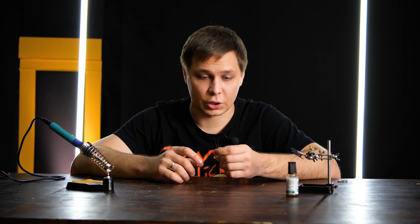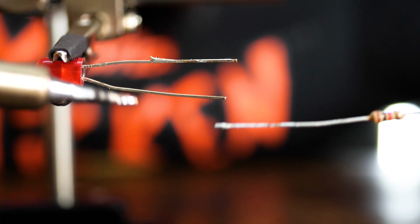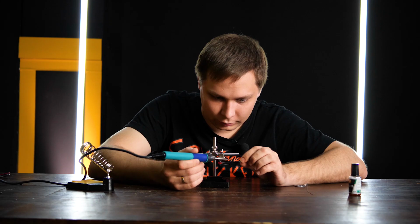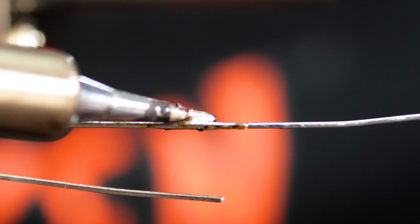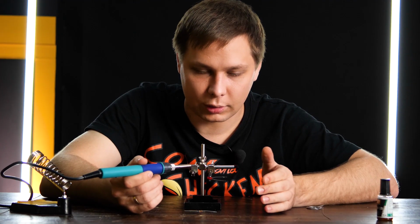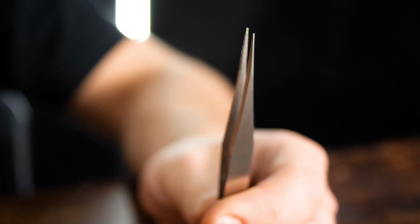It's a problem if you have to solder something in the air. It's not just that your hands tend to shake, it's that the terminations are metal and conduct heat, so it really hurts to hold them in your hands. And you must hold the part, because if you let go right after soldering it, the part will fall down. So it's best to use soldering forceps or tweezers.